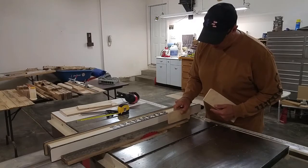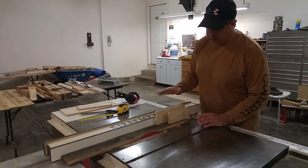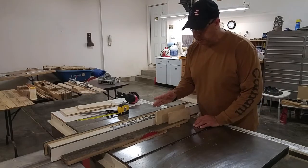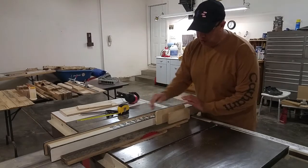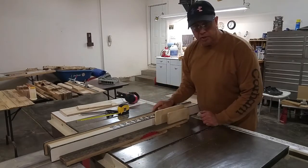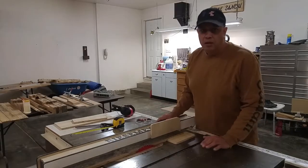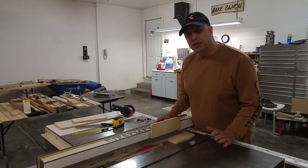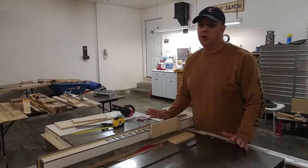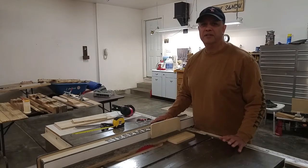Here's my old one and here's the newer one. The reason I wanted to make a bigger one was because it's a little bit taller, which keeps my hand a little bit farther away from the blade, and it's a little bit longer — so as you're pushing it past the blade, it gives you a little bit more pressure on a longer piece of the wood you're cutting. I hope this gives you some ideas on things you'd like to build. If you like my videos, please give me a thumbs up, and as always, please leave a comment or a suggestion. Take care, have fun.